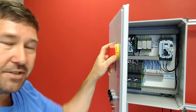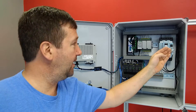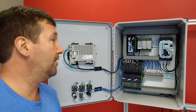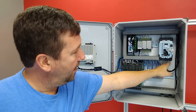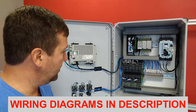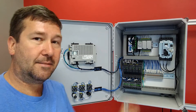This is our disconnect switch, which is tied to our breaker through the shaft disconnect. There's probably somebody who's going to say you can never get those lined up — well yeah, you can. I've got a video down in the description that'll show you exactly how. Our incoming power comes in the top of the breaker and comes out of the bottom, and with these diagrams we can trace them to these three motor starters and this power supply.